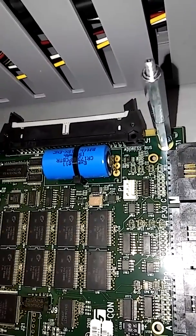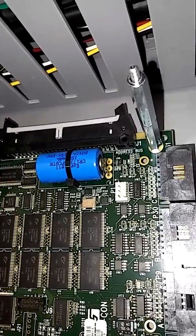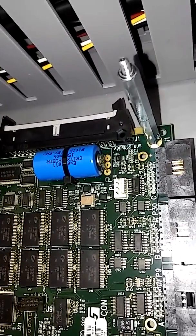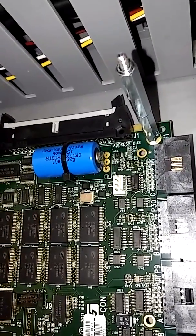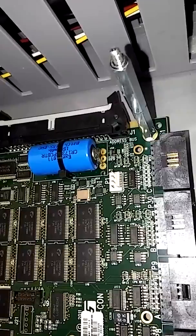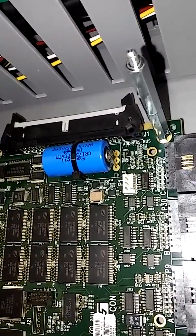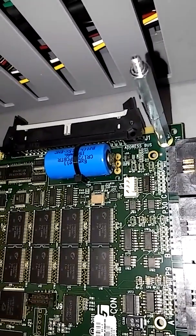If you just plug an external battery onto it, it's wired in parallel with the onboard battery, and the onboard battery will try to charge itself from the new battery, which means they'll both go down to half charge relatively quickly. It might run for a while but it's just not a good idea. Let's put a new battery on with a replaceable base — these are the units we sell — and we're going to remove that primary blue battery from the board.